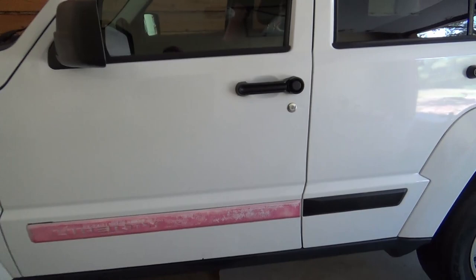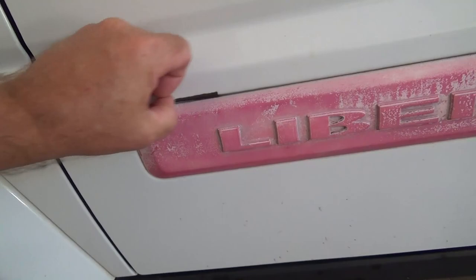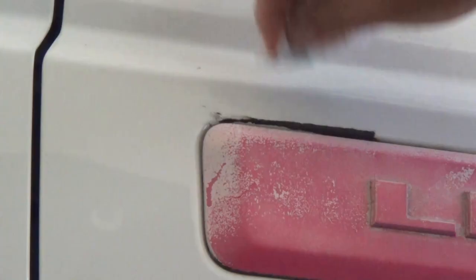Paper is off and it's looking pretty good. Now I have to go through here and tape this off. It looks like there's some kind of tar or something — you want to make sure you get that all cleaned up. Even though it's not the surface you're painting, you want it clean so you're not having to rub on the fresh paint. I'm going to give this a light sanding on probably 150 grit, wipe it all down with mineral spirits, let it dry, then tape it off and prep it for painting.